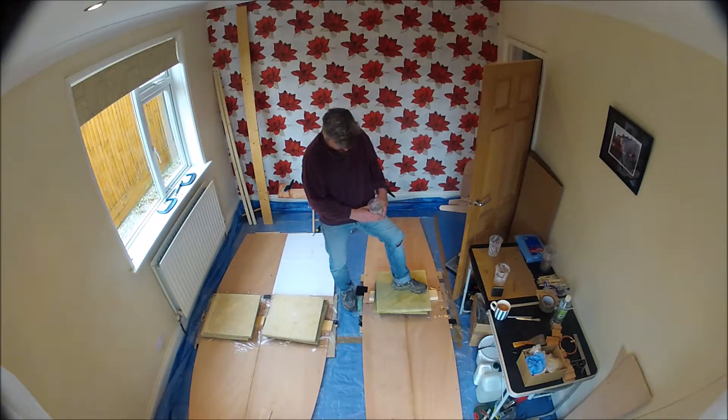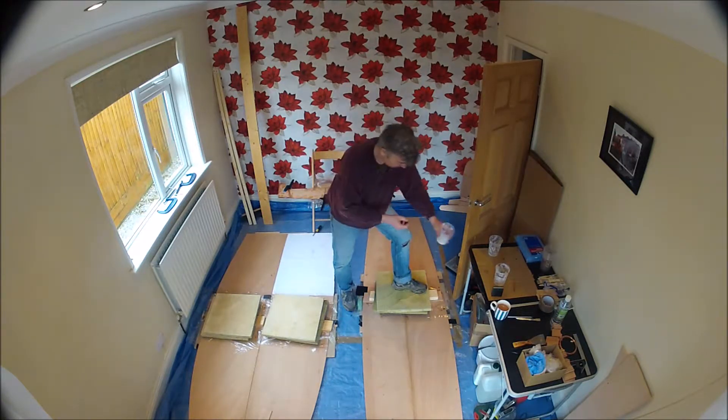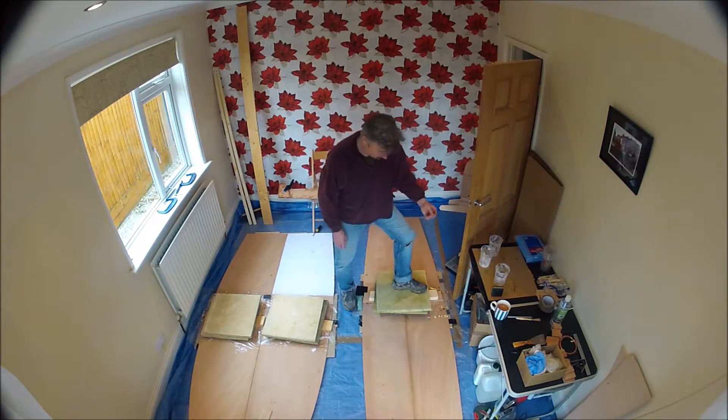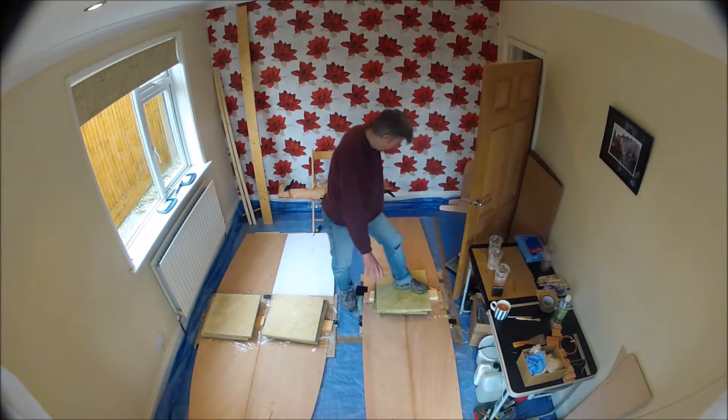This second one is not quite as solid. Let's grab a piece out and have a look. Yeah, that is still a little bit rubbery. So that's probably two and a half to three hours less curing time during the daytime. It's very rubbery - also it could be a different mix, so there could have been slightly less hardener in that one.